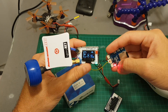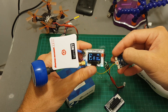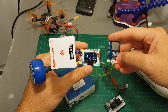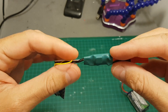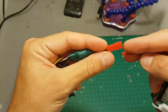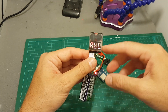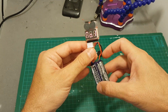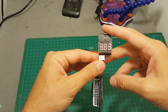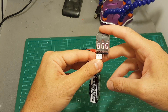It's quite easy and it provides a very simple solution for recording on the go. It's probably one of the cheapest ways for you to make your own DVR recorder and diversity receiver. As mentioned, you can use the video out and connect it to the video in of any goggles or any screen. As a final touch, I added a heat shrink on top. I also recommend using a buzzer to monitor battery voltage so the battery doesn't go too low. Thank you for watching — I hope you enjoyed it and found it useful. If you did, please subscribe and share it with your friends.